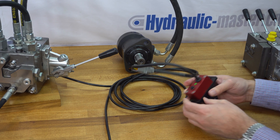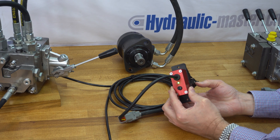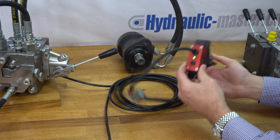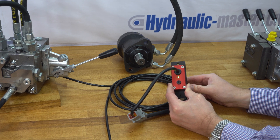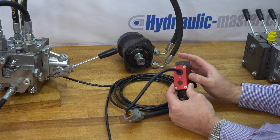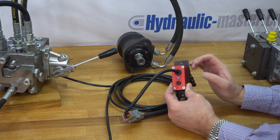Something worth mentioning — on the back of the switch, all the switches are the same — is that when you first turn it on or connect it, the switches should be in a neutral position. You'll see a small green light at the back, which means it's ready to go and will work. When you start to move the switch, the light changes to a blue LED in both directions, meaning the power is in use and the switch is functioning correctly. If the light is red when you connect it, something is wrong — normally the switch is not in a neutral position. Very easy to fix: turn the power off, put it in neutral, and turn it back on again.